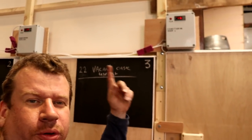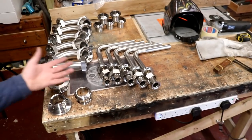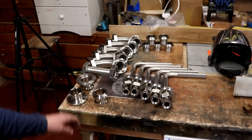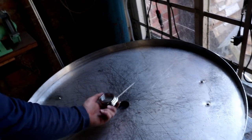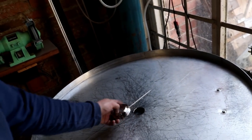It's kind of nice to see the cold rooms all working. We've got the end one turned off because we've moved everything across into the other ones. I'm just about to finish off welding the lids for these tanks, but all the other fittings are there — five fittings for five tanks, plus the sight glass, the diaphragm valve, and the adapter. I might be making another adapter, we shall see. I just need to pop these bad boys on from the underside, but the best side to get the weld on is from here, so I have to clamp them underneath and weld from this side.